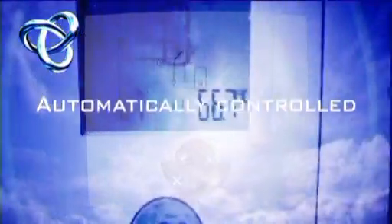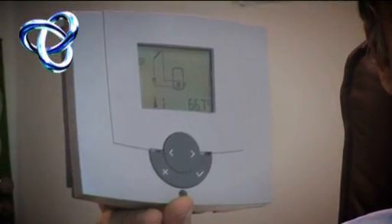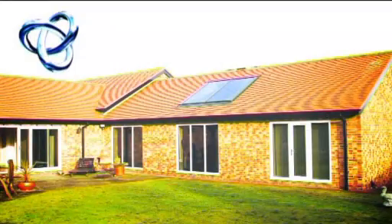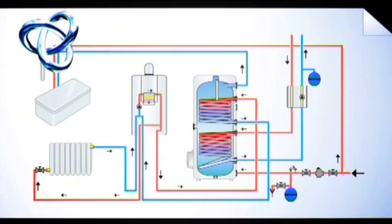We have a system in Genesis of regulating the energy in the cylinder by using a digital controller. It's a piece of hardware containing software, with sensors that go from this to sense the temperature in the solar panels on your roof and the temperature in the hot water cylinder. When there's a sufficient differential — when the solar panels are more than roughly 8 or 10 degrees higher than the temperature in your cylinder,